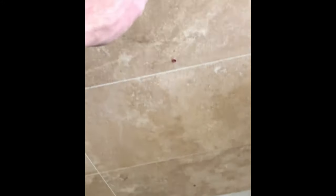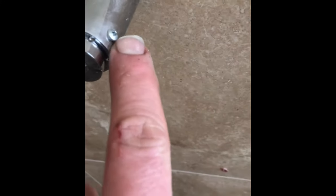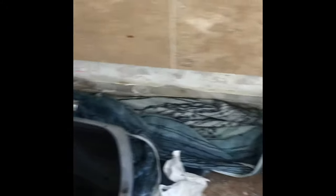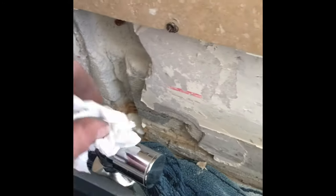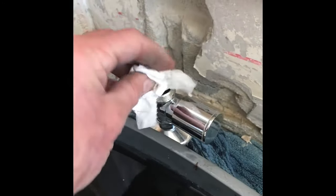The last thing is to take these fixings off. Just unscrew the collar - that comes off - and then there'll be another screw inside, so do that and you're done start to finish. Fittings all out and as you can see we're just left with the tails. You can leave them like that, but as a precaution take some tape over the top to prevent your fingers going in and playing with all the water.